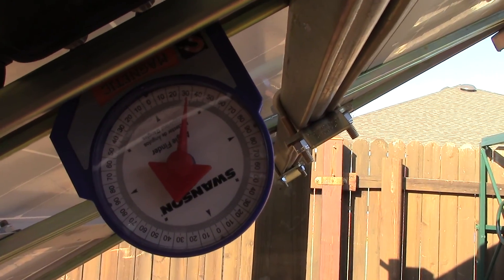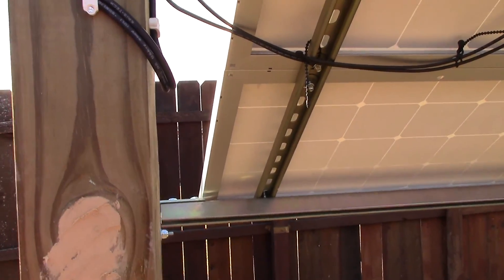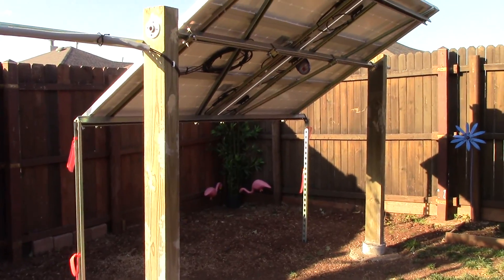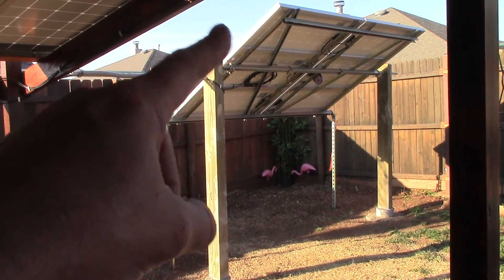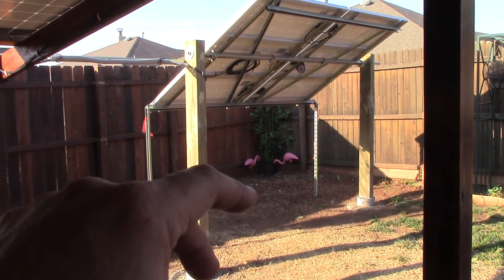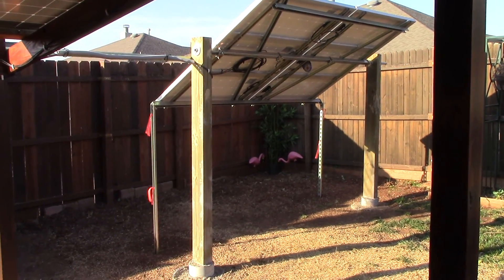All this wiring will be hidden — it's all going to be in a white tube going right in there, looking fancy. I'll stain the posts and all that, but I'm really happy with the power it's producing early in the morning — that was the whole point. I had it wired in total series and my morning power wasn't coming up properly, so I rewired it series-parallel, and then back to full series. Now as soon as the sun hits those panels in the morning, all six of them just come to life. That's exactly what I wanted.